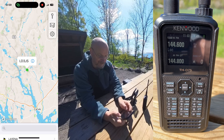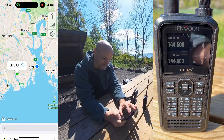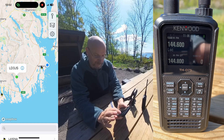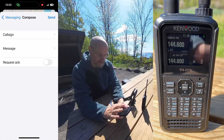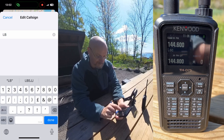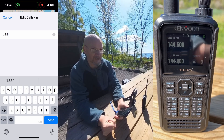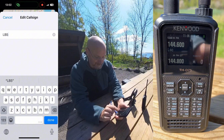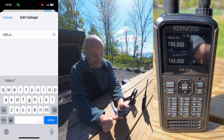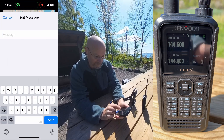While the map is populating we are slowly getting some more objects. Let's try and send a message. I can try sending a message to my computer at home, which is connected as Lima Bravo 5 Juliet Juliet running the Pinpoint APRS application over RF. So if I reach a repeater and digipeater from here, I should be able to send a message to that station and also get an automatic reply.